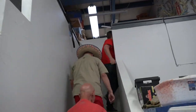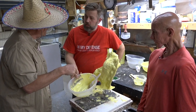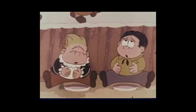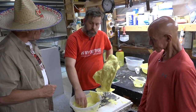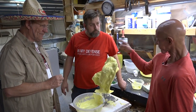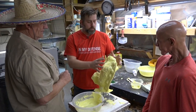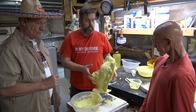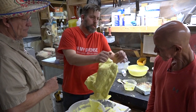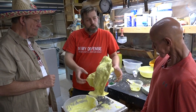Let's do it! This material is all dried up right now, but this is the material we use to put over the top of the clay sculpture in order to create a rubber mold. We need to put a plaster mold over the top of that. This line right here is a registration line — this will be cut open and split right there. That's where the mold separates so we can get the sculpture out.